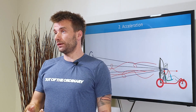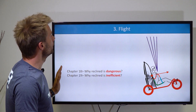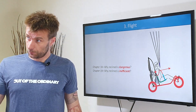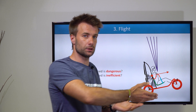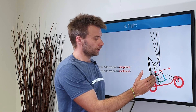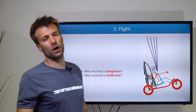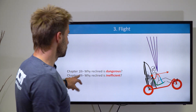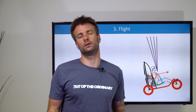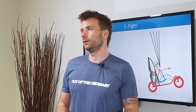But this is not the end of the story — it will actually be wrong in the air as well. Luckily, you succeeded in bringing the glider up, you have it above your head at 12 o'clock, and you accelerate into takeoff. Right after takeoff, your front wheel gets lifted — you need the front wheel slightly higher so you're ready for a smooth landing. But the prop is reclined as well, so the thrust line is pointing upwards. If you haven't checked our previous chapters, please see chapters 18 and 19, where I discussed why a reclined paramotor is first dangerous and secondly terribly inefficient. You want the prop to give you thrust to push you forward and the glider to give you lift upwards.